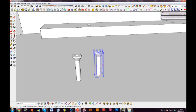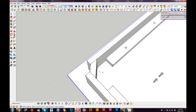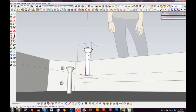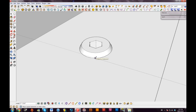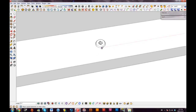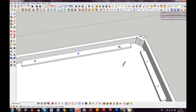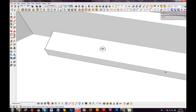I'll duplicate this screw and bring it over here, and bring it up an inch. We need to make the screws a little bit longer on these end pieces, because an inch and a quarter isn't really going to be long enough to go into the leg. Right click and make sure you hit Make Unique so it doesn't edit this screw when you change it. Go into isolation and make this one a half an inch longer. Now take the first screw and duplicate it — all you have to do is align it with the same face on the circle as the one on the screw, and it will align properly. You can see it fits into the screw hole. Duplicate these for the rest of the holes, and you can put these in the shorter pieces as well.